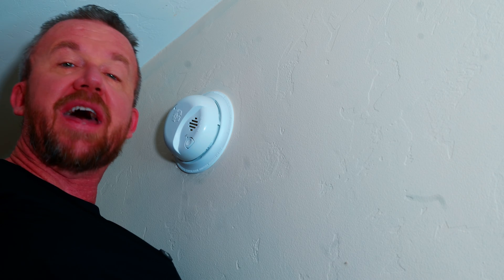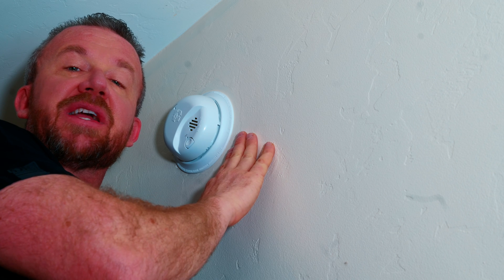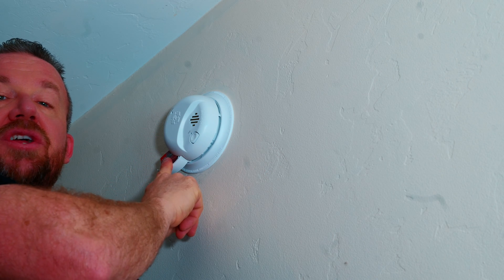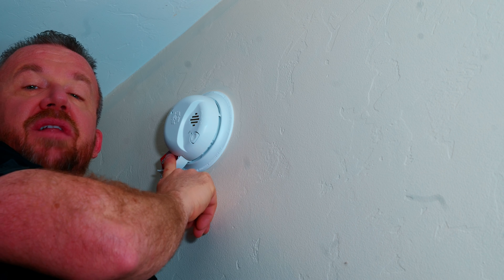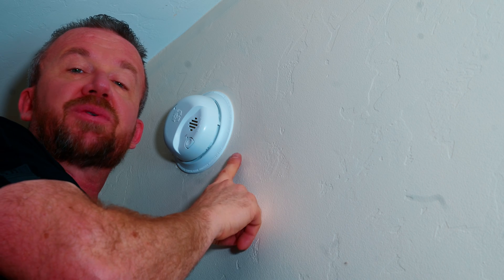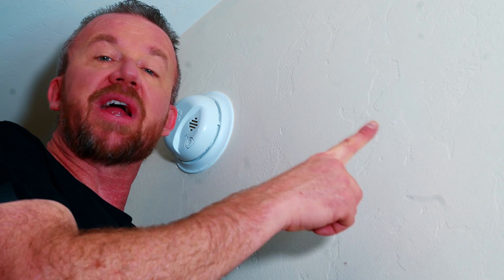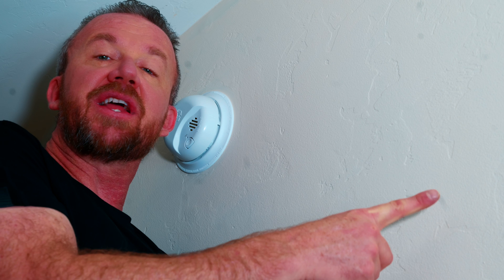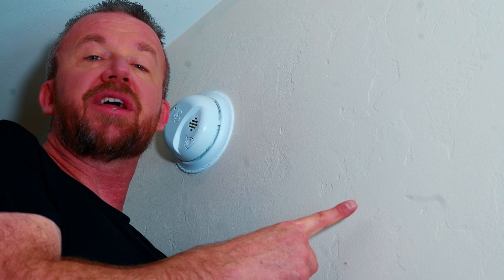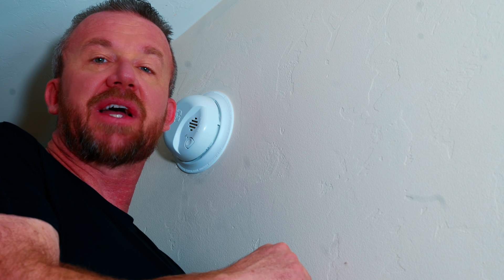And that is how you completely replace your AC powered smoke detector — it's super easy. Now if you're just changing a battery, that's even easier. It has a little battery tray right there; you can pull out your nine volt battery and change that out. They will chirp once the battery gets low — that's how you know. Now you should be able to confidently change your entire smoke detector out on your own without having to hire anybody. If you enjoyed this video, watch this one right here — I know you're going to love it. And if you haven't done so already, subscribe to the channel. It truly does help us out. I appreciate it. Tell your friends about us, throw a comment in, and let me know how I did and any videos you'd like to see next.